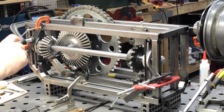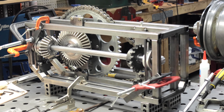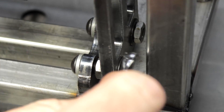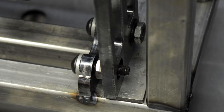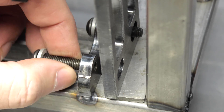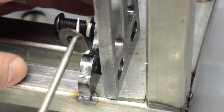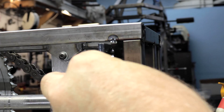I just tack welded here, here, here and here. I'm going to take all the excess out so I can give these things a better tack weld on the other side — it's still all going to be just tack weld. Some of these bolts and fixtures are getting difficult to get to and I've started a small collection of custom tools for this bike, including this stubby little 7/16 inch wrench that's also been ground to be much narrower than usual. Picks come in really handy turning these jam nuts and getting them in place. I'm hoping these jam nuts with some Loctite will be sufficient to hold with the forces on the drive shaft bearings. If not though, I figure I can get them into the best position possible and then just weld everything down if necessary. It's a bit of a surgical-like procedure to get these things in and out, but it's okay and can be done with a little bit of practice.